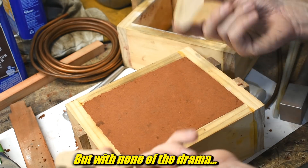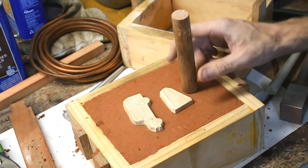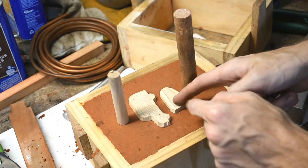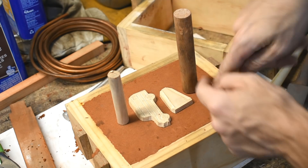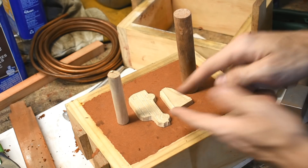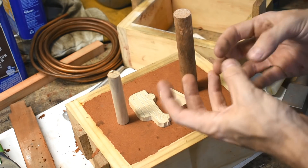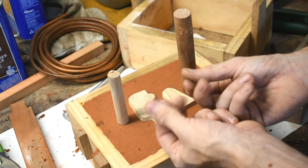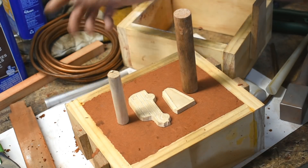Traditionally, the way I used to do this gating system — I would have the metal flow in through big honking in-gates, cut from here to here, and then a big honking out-gate. The metal would gush down this gigantic hole, go through a sloppy turbulent thing, and there would be changes in diameter throughout the system. The metal would just be pouring down like a big turbulent mess, stirring up all the sand. Any air, sand, or crap would have to flow into the patterns before going out a giant, ridiculous hole. This setup is very bad. Any air that gets mixed in from the turbulence, any of the oxide layer mixed up in the turbulence, goes right into your part. You end up with crappy castings — sand mixed in there, inclusions, porosity. That's how I cast for a long time. It's bad.